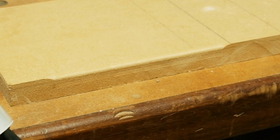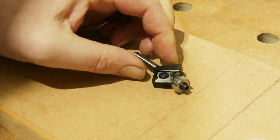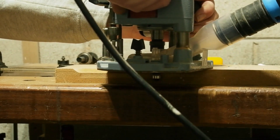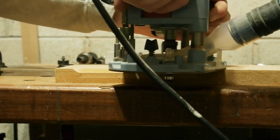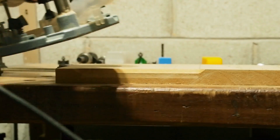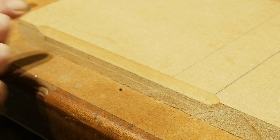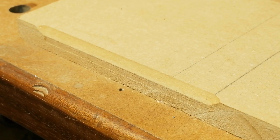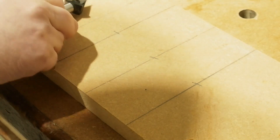I've swapped the blades over to their straight edge for a chamfer cut. This quarter-inch shank bit is quite happy running at full chat on the little router — lovely and smooth. Once again in chamfer mode the edges are nice and clean, no furring. Quite a handy little bit, this two-in-one. With these carbide blades you can rotate them when they become dull to the opposing edge, to continue cutting like new before splurging on new blades.